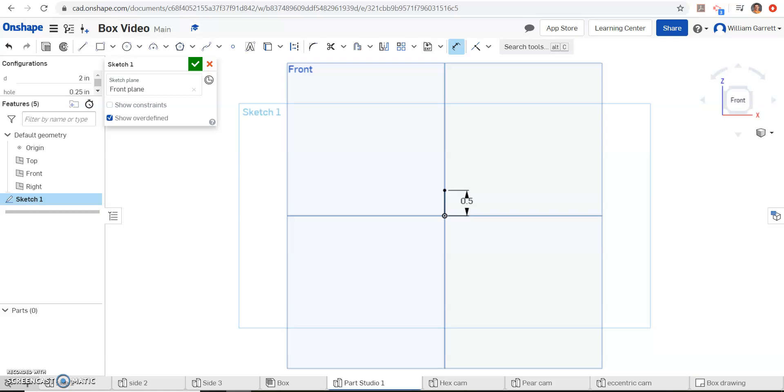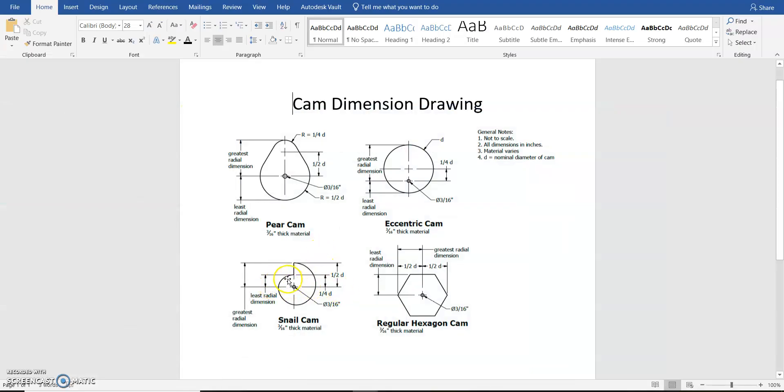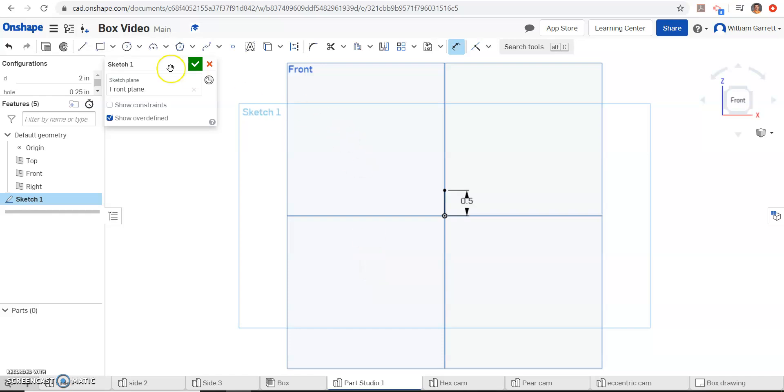When we come to the side, it's getting larger as we go. I'm going to break it down into 16ths: going up, 1/4 is 4 sixteenths, and 1/2 all the way up would be 8 sixteenths. So I can break it down into segments — 5 sixteenths, 6 sixteenths, 7 sixteenths — making it easier when we get to the end. So we're going to make a second line, starting at the origin and going straight to the left. I dimension it as 5/16 times D, hit enter twice, and that gives us that line.